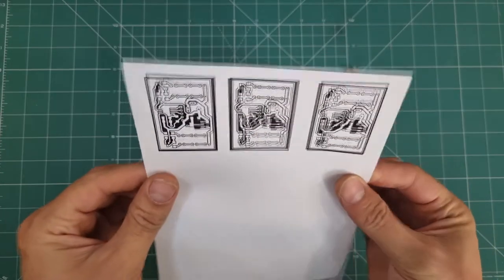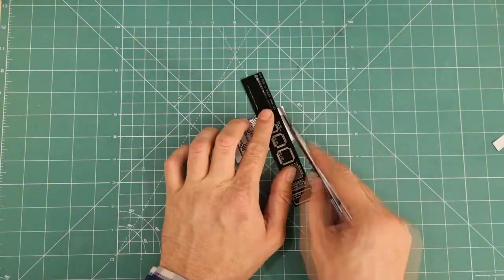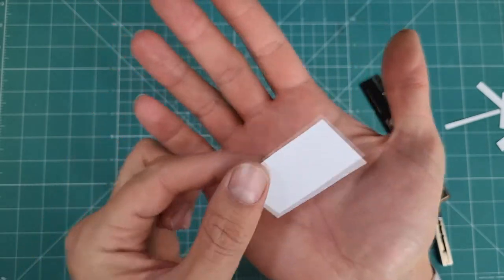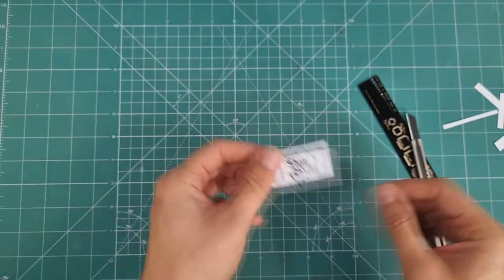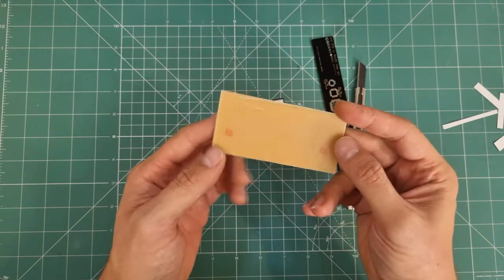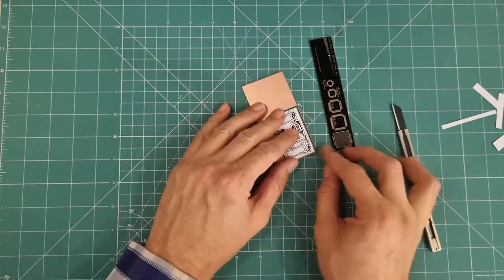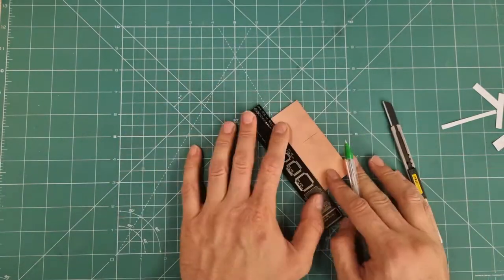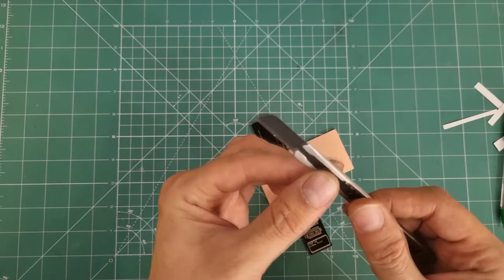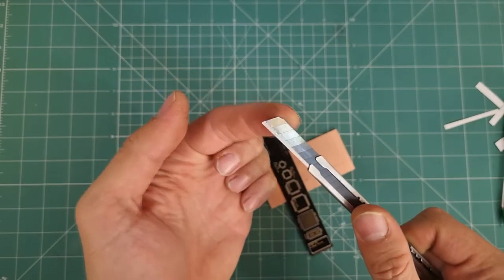After printing the film, cut it in actual size. Take a piece of bare copperclad board and draw cut lines on it, then cut it by blunt edge of a cutter. Here is the blunt edge.